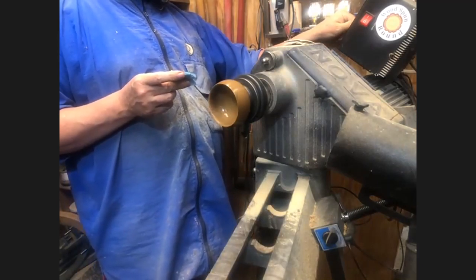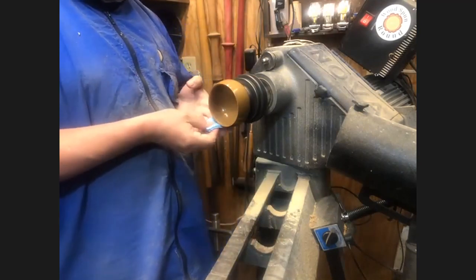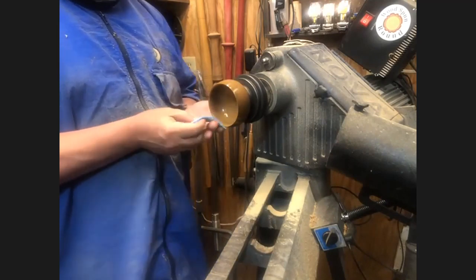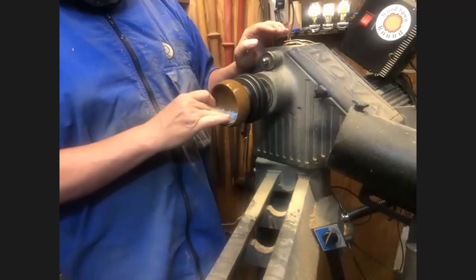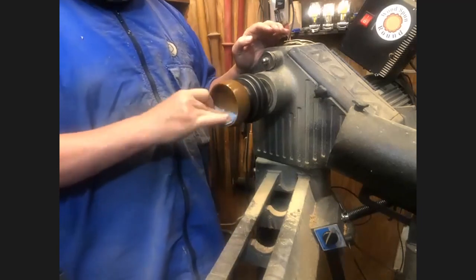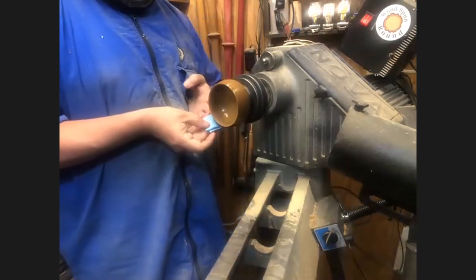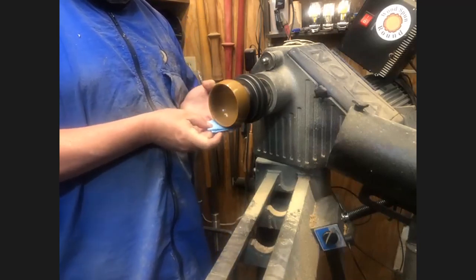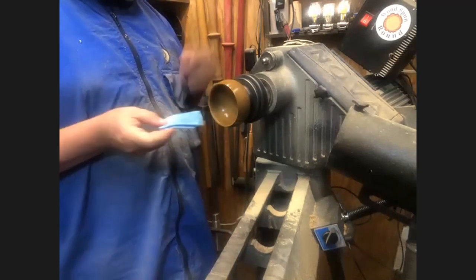Just want to go back down to, what, 400? Just work that wax in a little bit. And this wax is like almost all other waxes. Less is more. You don't need a whole lot. Spread it on there thin. Work it a bit until it gets just a little bit tacky. And once it does, what that tells you is that the solvents that are in there, whatever they might be, have flashed off a bit.